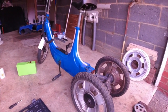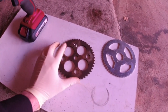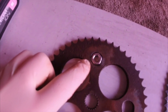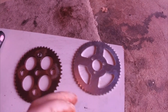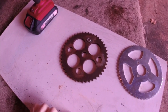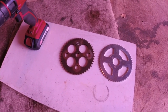We've got the original sprocket here and we're going to weld some nuts in and then put bolts through there to attach to it. We're going to have to drill in these places and then clamp it together. At the moment we're using this to get some of the rust out of the way so the weld will attach better. We're hoping that's going to work. Hope is not a strategy, but this is a strategy — so let's hope it works out. It will work.